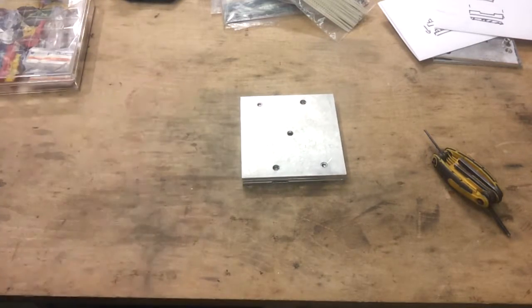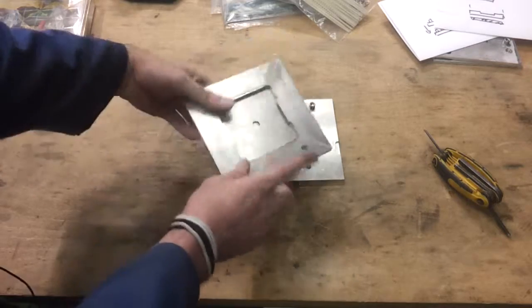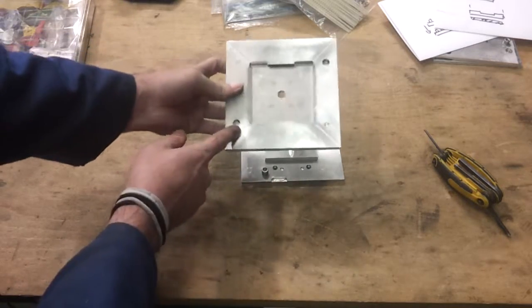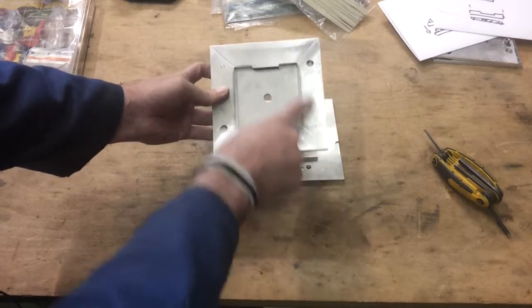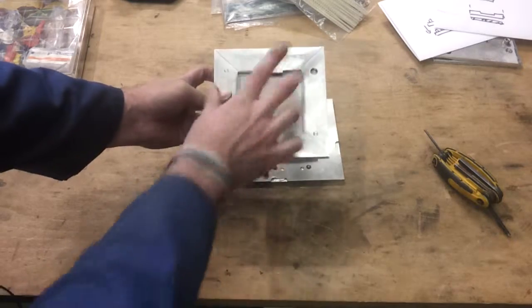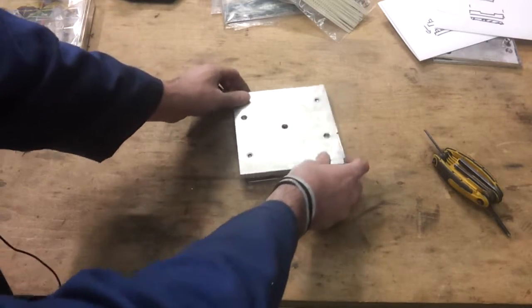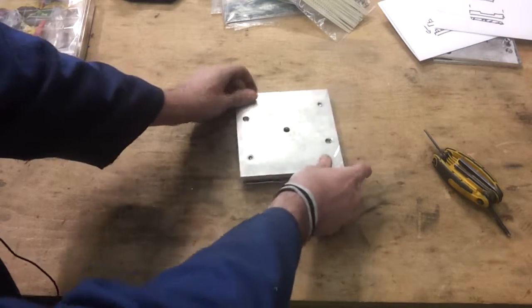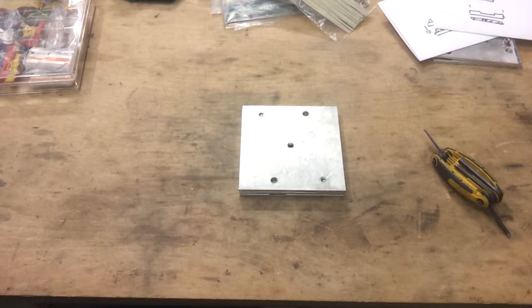Now we just have to stick that in the moulding machine. I've got some plastic drying — going to be running some ABS on this. I've also added some vents on the back which I forgot to film — these are just 50 micron deep with a slightly deeper channel to take the air to the outside. Without those we're going to get air pockets at the corners and it won't fill properly. Apart from that little modification, everything is as per the original schematics.